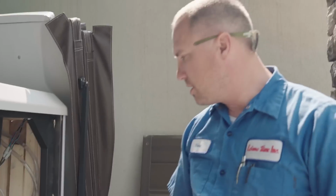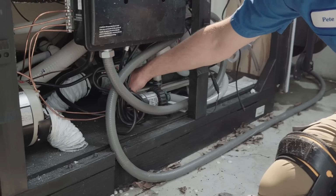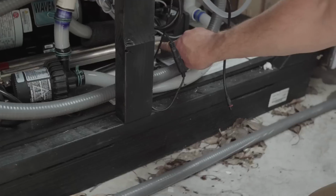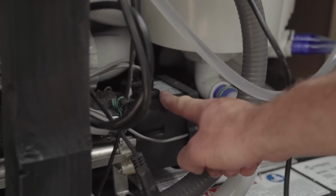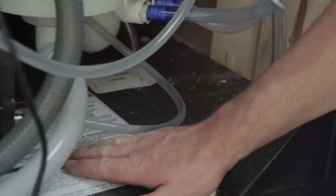Second thing is a typical leaking position. We'd inspect the heater. The end cap here on the inside is a good leaking spot. We'd also take a look at anywhere there's an O-ring, a connection, so the sensors go in here. I don't see any leaking there. And then you have the bleeder line on the end over here. Again, everything's dry, no sign of leaking.